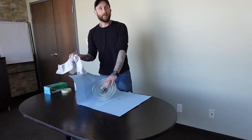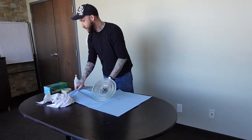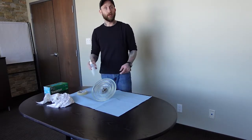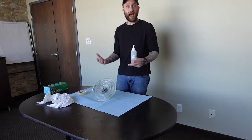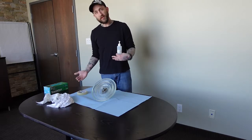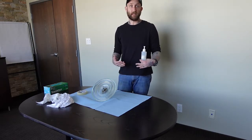We're going to show you how to set up, what type of equipment to use, and how to get the most efficient way of doing your project. You're going to need some clean rags, some gloves, just some regular masking tape, as well as some type of solvent. Here today we're using isopropyl alcohol. You can also use acetone, but basically we're looking for anything that's going to remove grease and flash off completely so you don't leave any residue on the surface of the insulator.